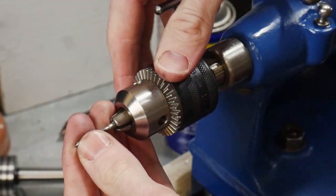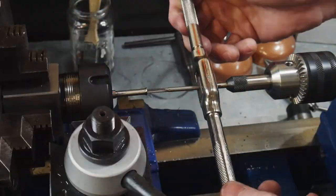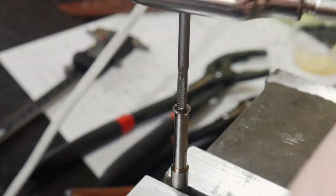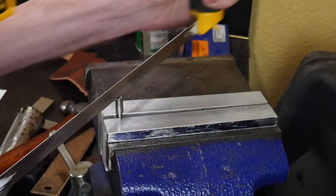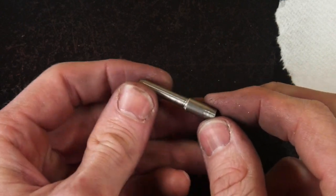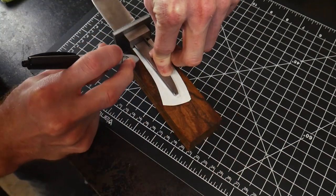For this finial I'm basically making a long female Corby fastener. The first thing I do is bring down the OD, then drill a hole through the center of the finial and tap that hole to 6-32. I got the thread started on the lathe and then moved over to the vise to finish them by hand. After the finial is threaded I put it in my drill and bring it over to the belt grinder to clean up the end where I was supporting it with the live center. I initially used a handsaw to put a slot in the end of the finial for a screwdriver, but later drilled an eighth inch hole perpendicular to the finial so I can put a drill bit through that hole to crank down on the nut more efficiently.